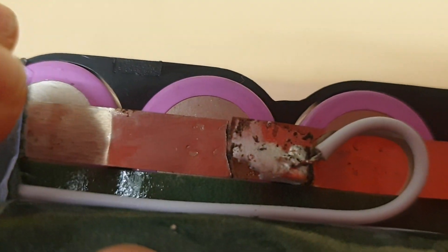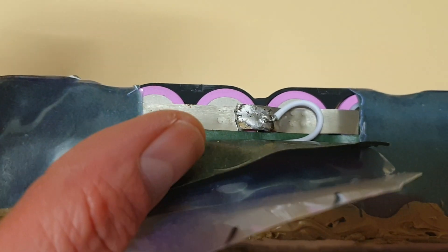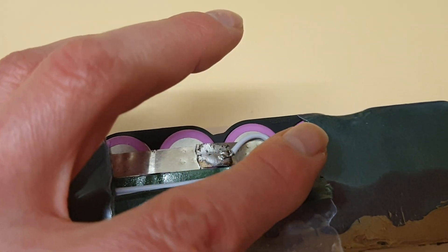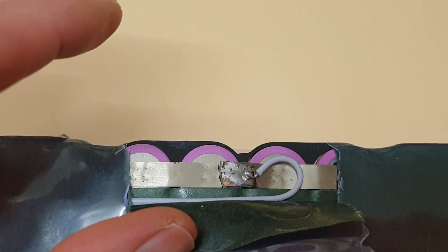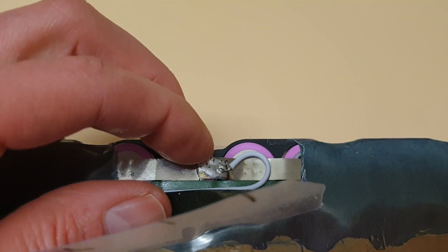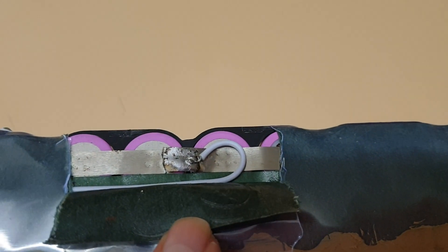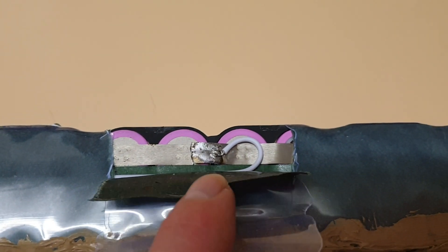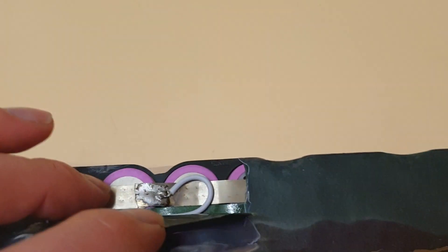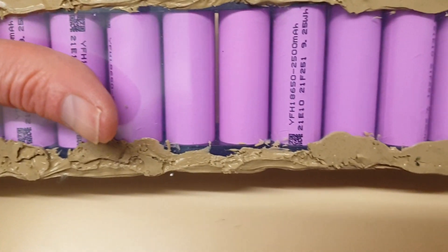This is the weak point, and the second battery I had was the same — a crack between cells. That one stopped working at all. This battery which was working was at 3.4 volts but the other cells were 3.8. It broke when it was at 3.8 — eventually I did only two cycles on that one battery and it was working even with one battery. So the cells were probably good, however one repair had faulty cells — it's possible one cell shorted and shorted the other two.